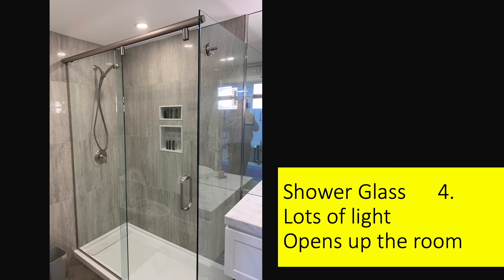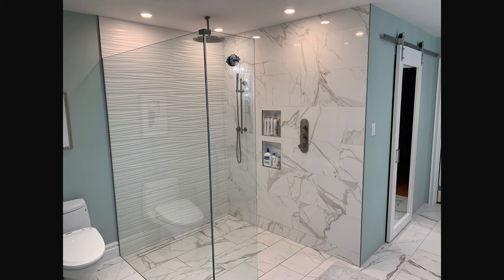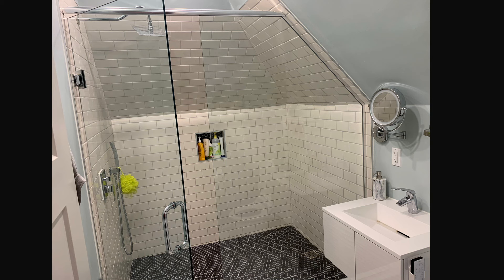Let's talk about shower glass. Shower glass works really well — it lets in lots of light and opens up the room. Here's our basement shower with glass on two sides, one with a door. In our ensuite bathroom we've got one wall and a quarter of a wall with glass. Note we haven't taken it right to the ceiling — if structurally safe, it's best not to go right to the ceiling, because this allows for ventilation and getting rid of steam. Here's another example: an attic bathroom where I solved the issue of a shower curtain by putting in a glass wall and an integrated door.